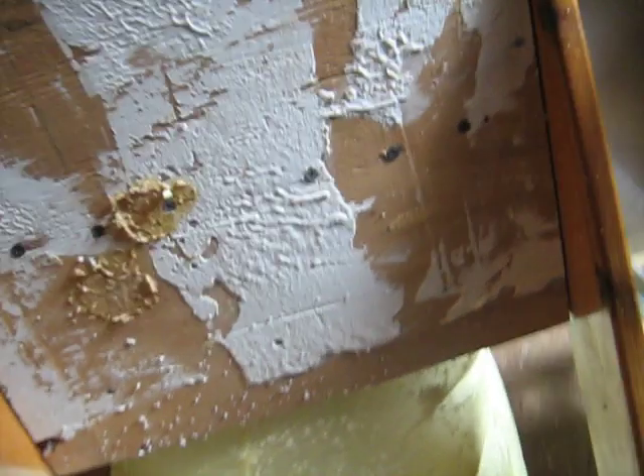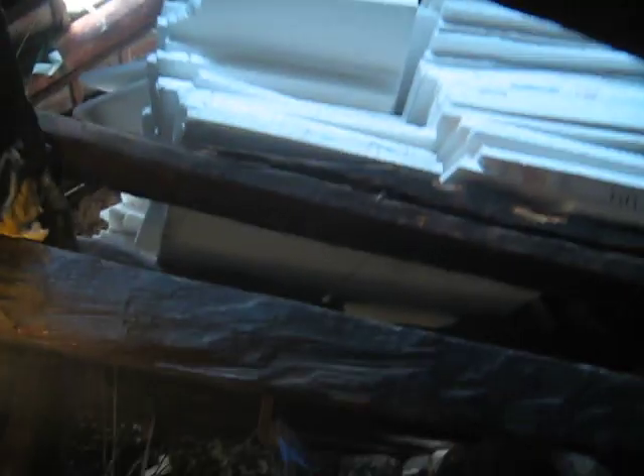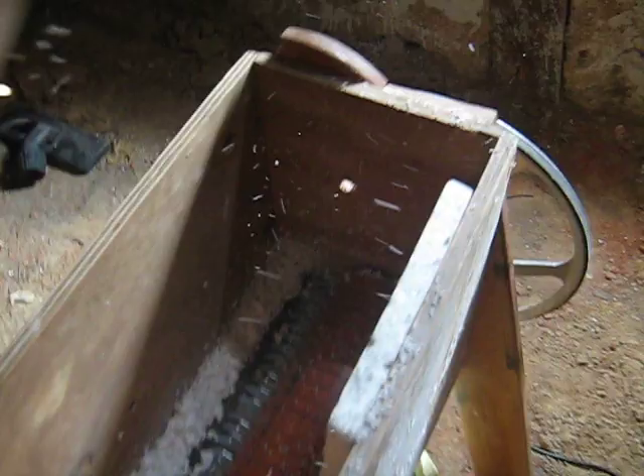I'll turn it off for a sec. What I'm actually doing is recycling the styrofoam, because it used to be inside the roof here. If I point up there, you can see I've got a huge amount of the stuff all through the roof, sitting on the beams at the moment. That was used to insulate this place, but not very well. Since we're rebuilding the roof, I'm going to be putting what's left — this small stuff, real beads of styrofoam — mixing it with loam mud and putting that in between the wooden frame. The thing is, styrofoam in itself is not porous, but with loam in between, I'm hoping to get the thermal warmth effect from the styrofoam and the porous, breathable effect from the loam, so that moisture can pass through the wall. Anyway, that's the styrofoam shredder.